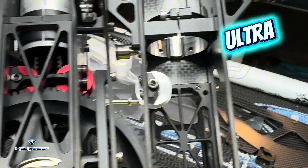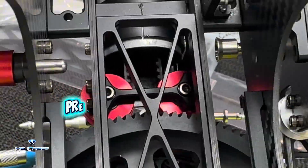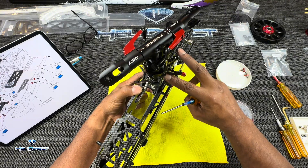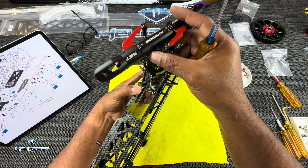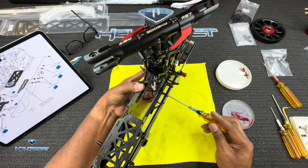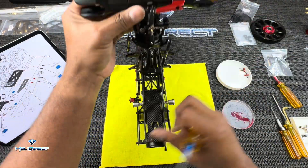This is the new RS7 Ultra — this one bolts in from the side and does not have a cross member. The belt tensioner was on the other side on the old style, where you have the cross member. Some of you guys building 700s for the first time: although all this stuff locks in the frames and you're pretty much guaranteed a true up-and-down flow of the main shaft, a good practice is to go up and down with the shaft, pause, and then tighten all the bearing blocks around it. That will ensure that you have free-moving movement with the main shaft.